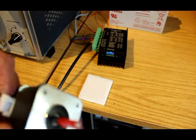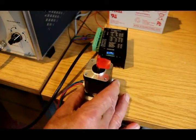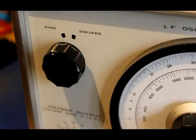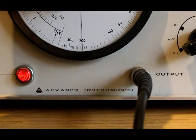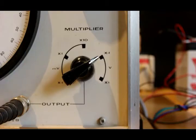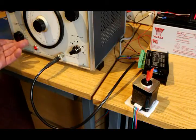Here's the motor — we'll plug the wires into the connector and place it on this piece of plastic for a reason which will soon emerge. The pulses needed to operate our driver have to be a square wave — on/off — so I select square wave. I'll now adjust the frequency to 200 hertz. The oscillator is set to 100 millivolts output, and that is enough to operate the system. If I increase this knob, the output will go from 0 to 100 millivolts, so let's do it.